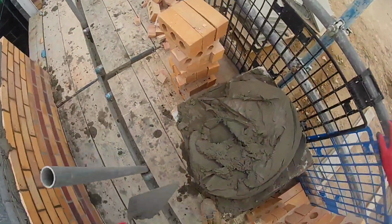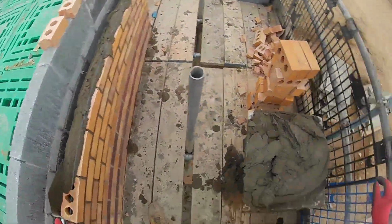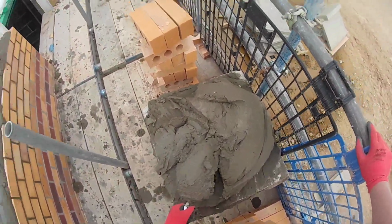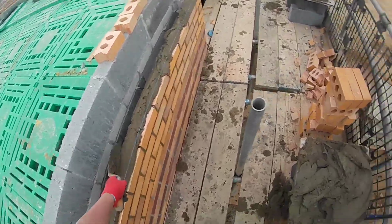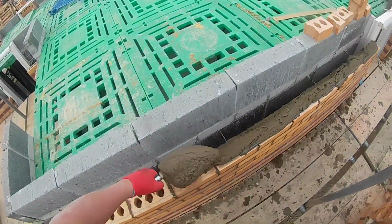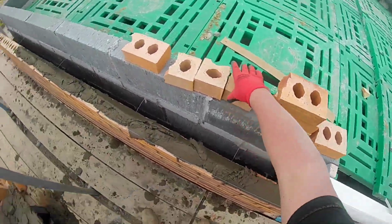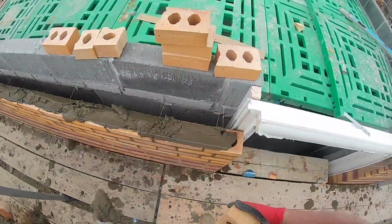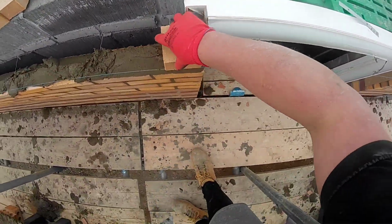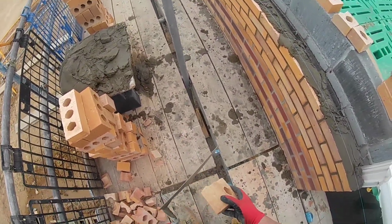But yeah, I go back to perping the brick, sort of traditional style. I still don't put any grooves in the spread, but the gobbo was pretty much holding up. It's Waites gobbo, or Waits, I can't remember. It's a Yorkshire company, so the gobbo lasts. It's sticky as hell, but it lasts really well, if you get it out at a good consistency. I'm more accustomed to a traditional consistency when I'm solo. If I've got a labourer with me, I'll maybe stiffen it up a bit.